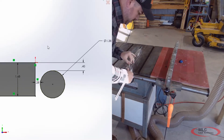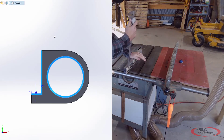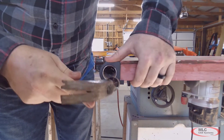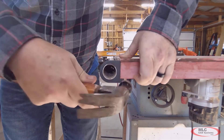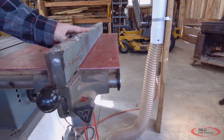By measuring the guide to the steel surface, I can design an alignment jig that holds this router table surface in place precisely. By adding fiber reinforcement, it's strong enough to install with a press fit, even using a hammer, while still being thin enough to stay out of the way of the rip fence.